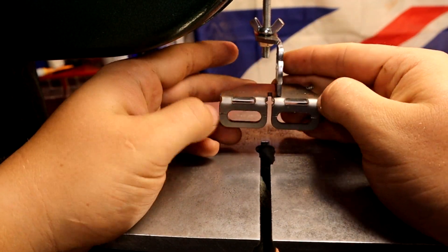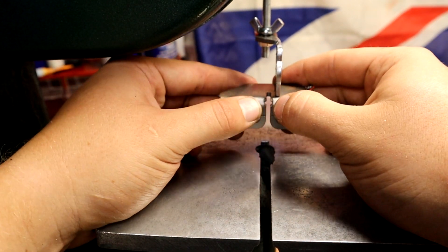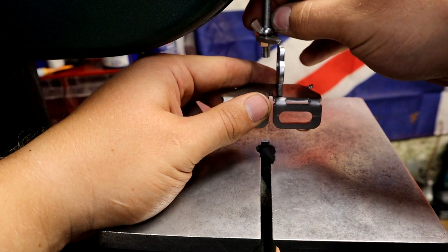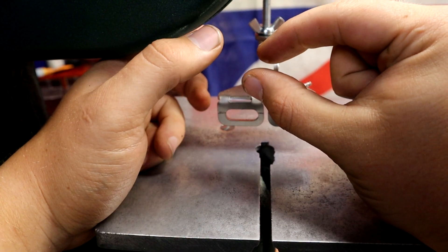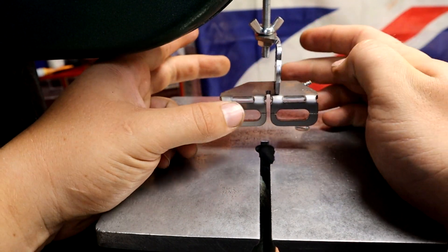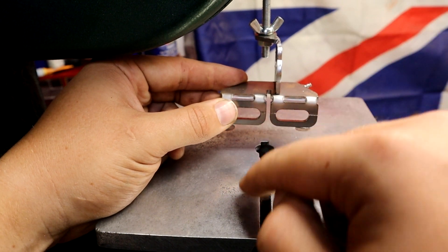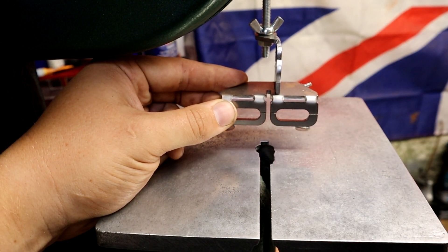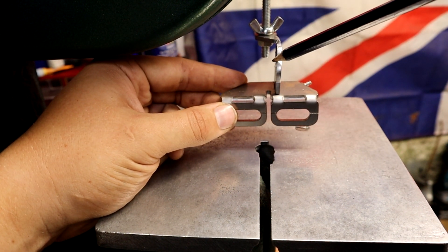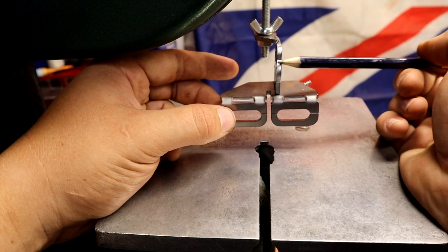Some of the camera angles are going to look a little dodgy, so I do apologize. What you've got to bear in mind is that the travel of the blade has to go into the center point here and the ball bearing guides. The adjustment has to cater for a variety of blade lengths — a quarter inch up to a half inch blade, different applications. You need traverse adjustment on the top as well as a little side to side. Working out the bend lines, the reliefs, the thickness of the bearing, the distance traveled, and the back and lateral adjustments were massively important. There's a lot of work that goes into this — it's not a case of draw it up in Fusion and it works. This has taken five attempts and I've yet to actually try it.